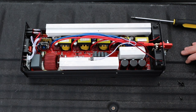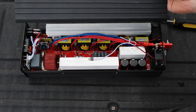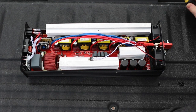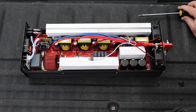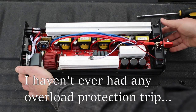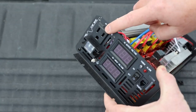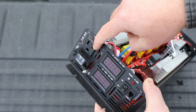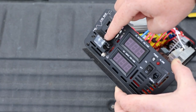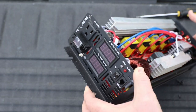The behavior of this thing - and probably how they're getting the 6000 watt number - is they're fudging things a bit. I don't think 3000 watts is true. I think if you ran this thing at 3000 watts continuously it would suffer. I think it can do it for short periods of time; I've hit 3000 watts for short periods. But about this 3000 watt inverter - the main output: you've got one standard plug and it's not even a 20 amp plug, it's a 15 amp plug, and then you've got these tiny little tie-ins if you want to plug something bigger.